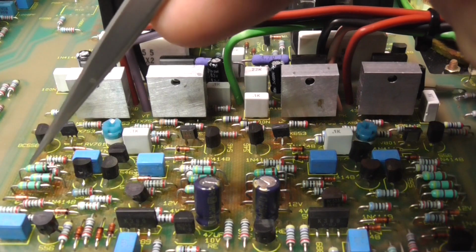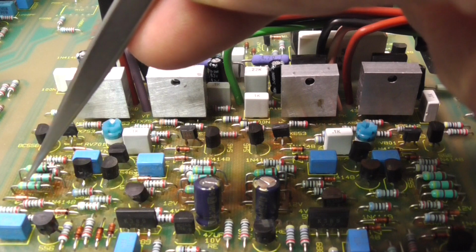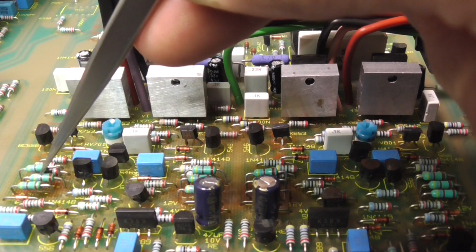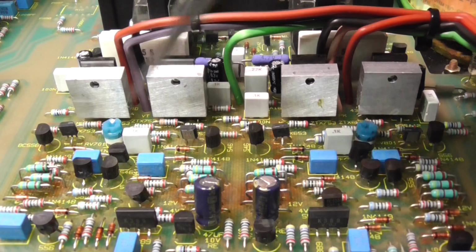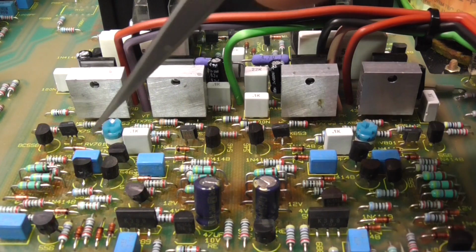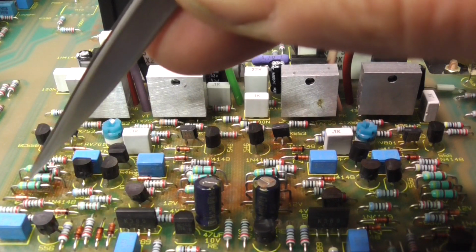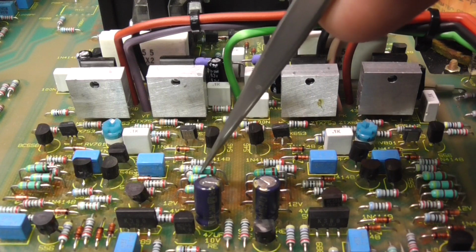And these resistors here are part of the regulator that takes the unregulated supply from the transformer and the main smoothing capacitors and drops it down. So these are 4K7 resistors, 3 in parallel, there and there. I've replaced the resistors simply because I wanted them lifted off the board, because you can see the way the board's gone brown due to the heat that these resistors run at.